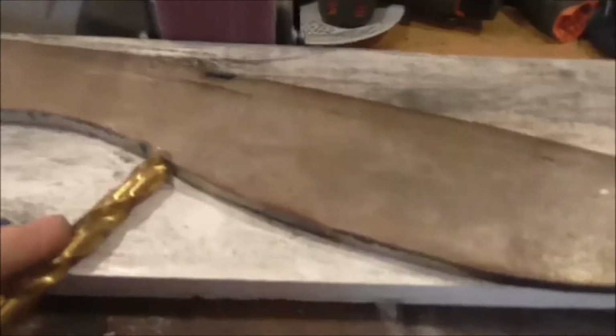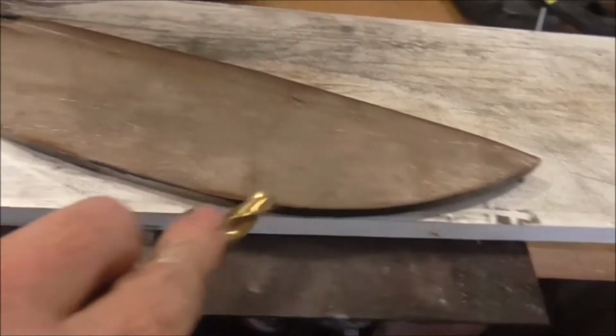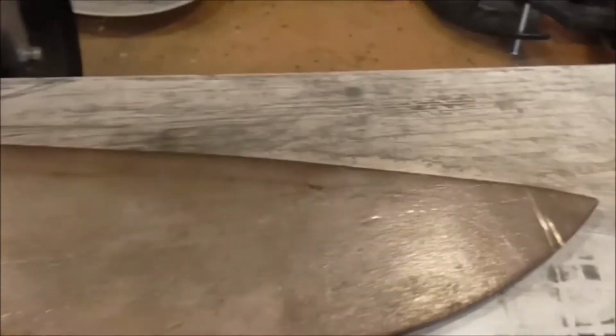So to have a little quick recap, I've got a 6mm drill. Just to show, it's not a 6mm drill, but you get a drill the same thickness as your steel, and you give it a good scratch right along the middle, so then you'll end up obviously 3mm up, 3mm down, bang on the centre.